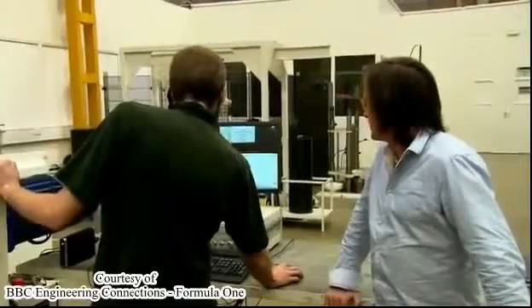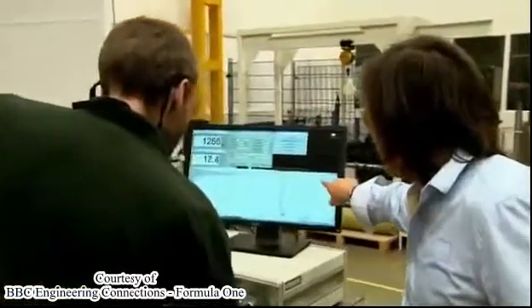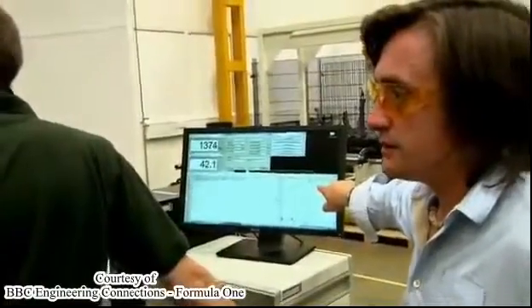It's yielding already, look. So what's this showing us? That's yield — the machine is about to fail. So any second now it's about to snap. So this machine is distorting now. You should be able to see it necking. Necking — here it means when a material gets thinner in cross-section. It's an indication it's just about to fail.